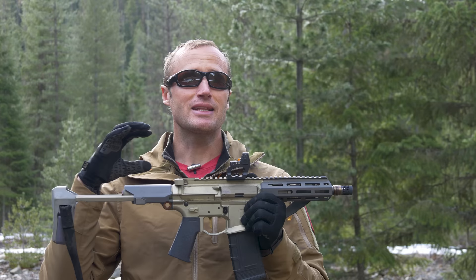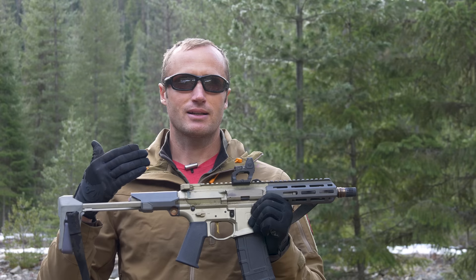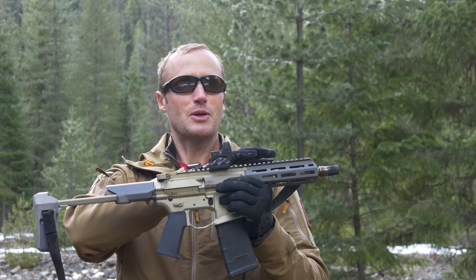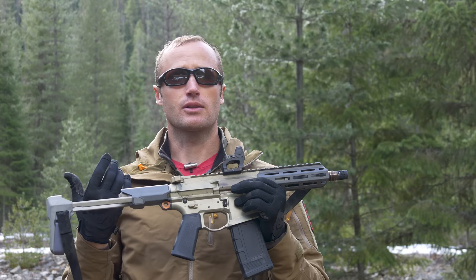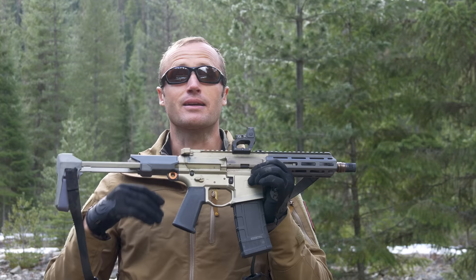One of the unique things people notice about this is the coloring. People keep asking Q: what's the Cerakote code for the color? That's not how this works. Originally, being designed for a special unit for hard use, the pragmatic question was: what's the strongest coating we can get? Anodizing when black is kind of a mess matching colors, and it's not as strong as clear anodizing, which is almost twice as thick. So this is all clear anodized — the receiver set made out of 7075 aluminum versus 6061 — and when clear anodized, you get the color of whatever the original material is. Same with the charging handle, same with the selector — all clear anodized.